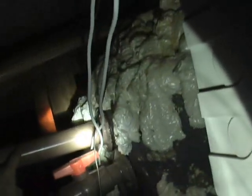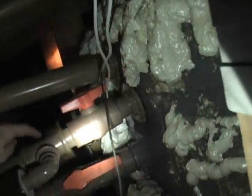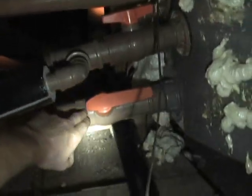In the back — it's kind of hard to see — I have the pipe that feeds it cold water. This pipe here is an overflow pipe, so you can never spill water into the house; it takes the water out to the soffit. This pipe feeds the house with hot water — it is on top. This is the return from the solar hot water heater, and this is the supply of cold water to the solar hot water heater.